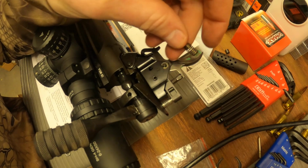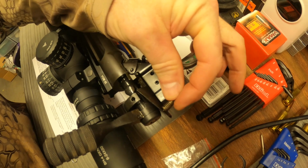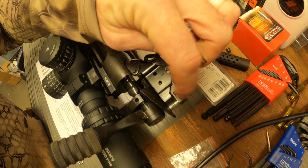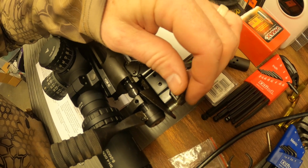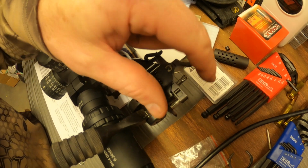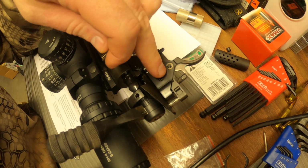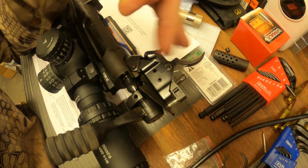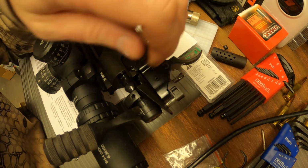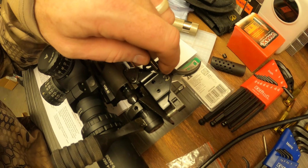So that little bitty wire on top fits up in that catch hole, and then this spring screws inside this trigger mechanism here. And like I said, the more spring you get, the tougher the pull. The less spring you get, the lighter the pull. So I'm going to drift this clip out, and we're going to drop this trigger, pull this assembly out, and then I'll unscrew this spring, swap it with this one, and see what kind of difference we have on the pull.